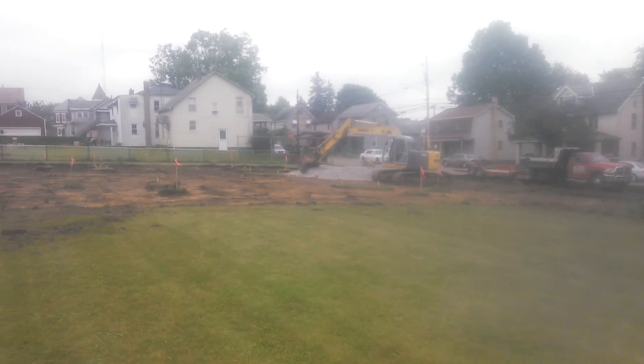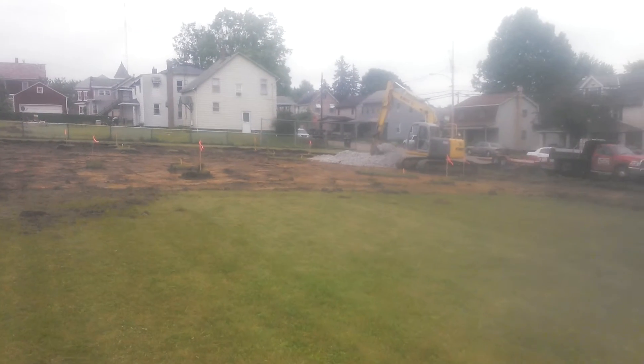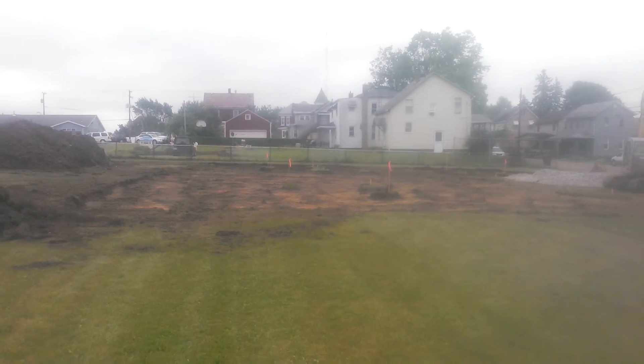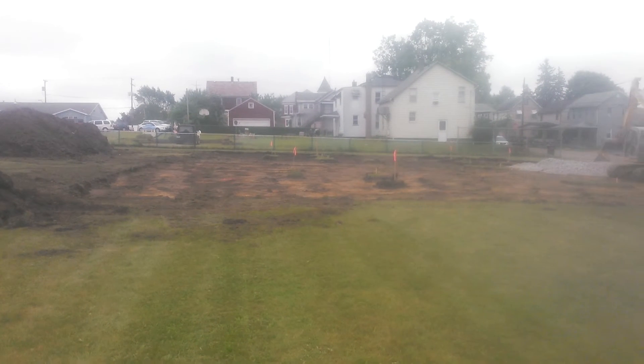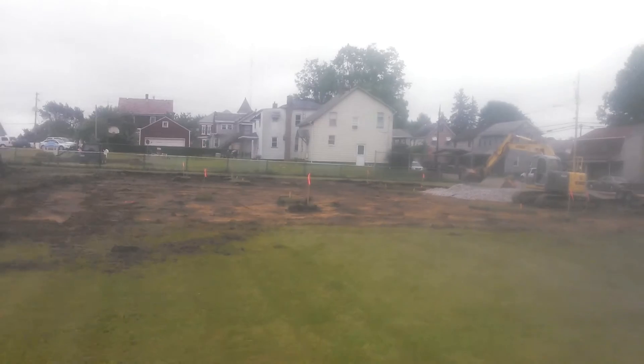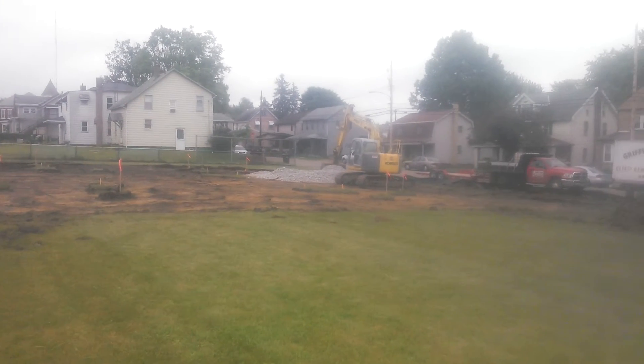This is day one of a new home that's going in town. There used to be a school that sat here. We went ahead and stripped the topsoil about 20 to 30 feet out from the house the whole way around it, and then we're just spending the last of the stone for the temporary drive.